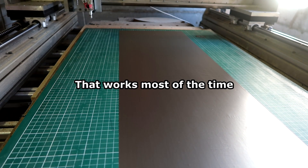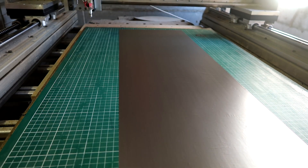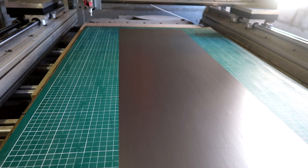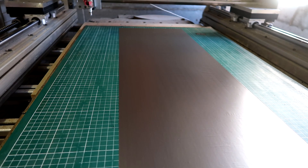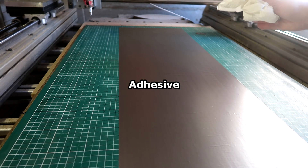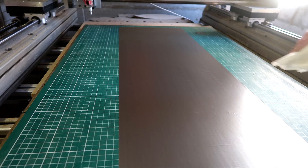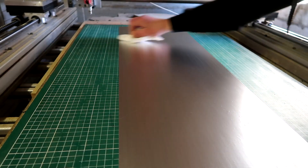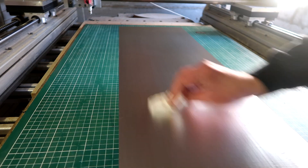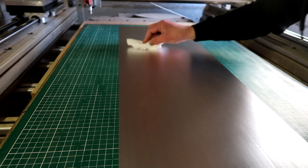The question is if this will cut correctly, because aluminium doesn't like to be cut and it might rip. I found a solution for that, but the method I'm going to use doesn't allow me to use it — if you give it a slight coat of glue, it cuts nicer and does not rip. But since I'm going to attach Kapton over this, which has the adhesion on the Kapton instead of the usual way I do it with mylar where the adhesion is on the aluminium. I use a 30-degree angled cutting blade for very thin materials, but that does not work, so I might switch to 45-degree, although that's usually for thicker materials.